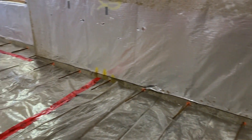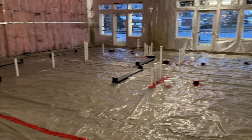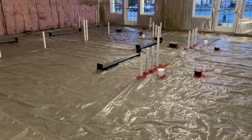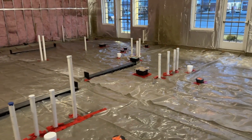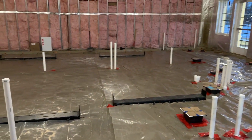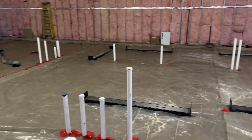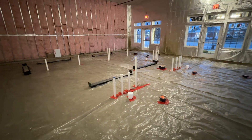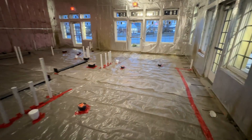Once the underground plumbing has been backfilled with pea gravel, the next thing to do is pour the concrete slab. The first thing we need to do is install the moisture barrier — the vapor barrier — which is this plastic tarp sheet. We lay it down neatly, tape it at its joints, and tape around any penetrations. This will prevent moisture from seeping up to the bottom of the concrete slab. As you can see, the concrete crew has installed this vapor barrier over the whole entire floor, so now you have the gravel and then the vapor barrier on top.